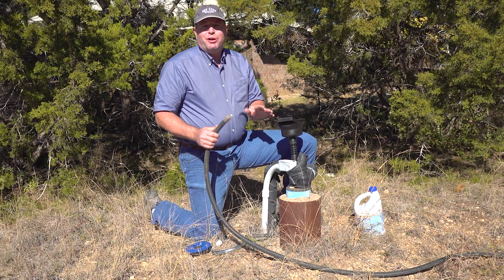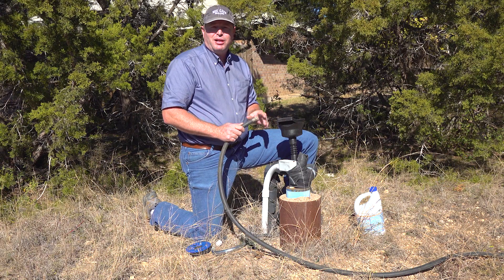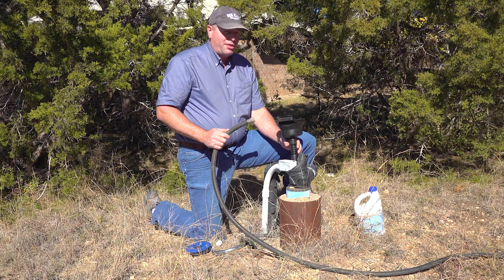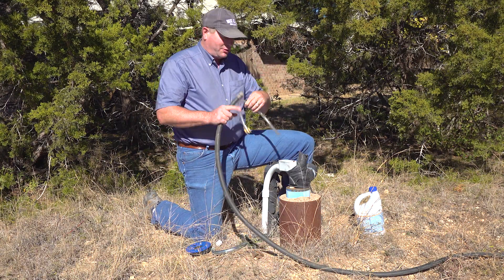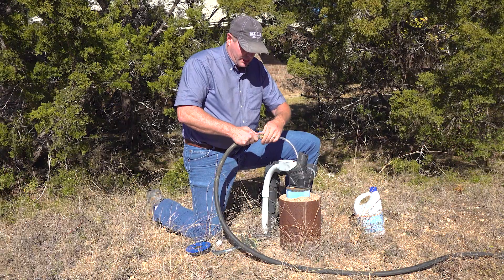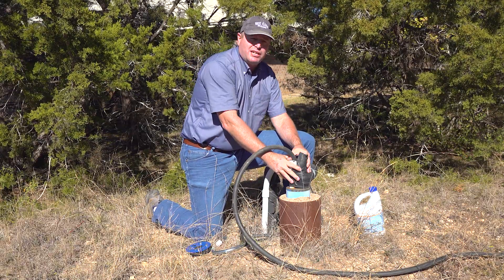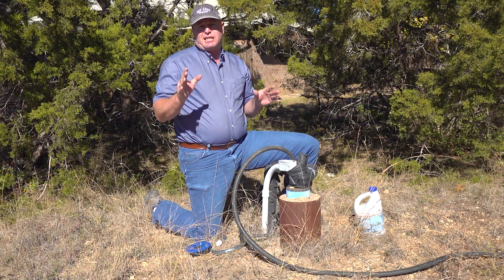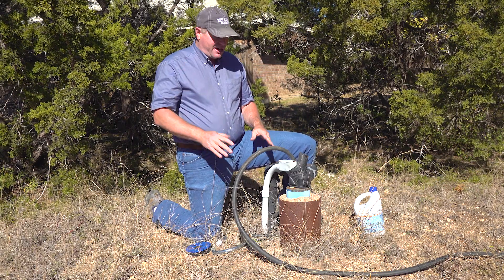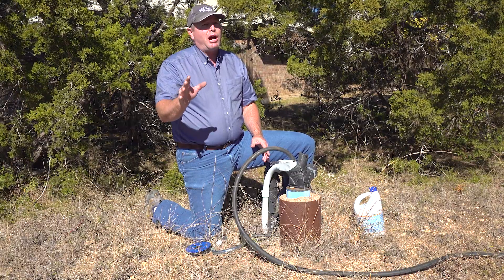Now that we've got our bleach in our well, we need to start mixing it. Run a water hose from the end point of your distribution over here and rinse everything down to make sure all the chlorine got down into the well. Then hook this up to temporarily circulate water. The best way is to ditch the funnel, go back to your clear hose, stick that right down into the well, and hook up your hose. This is going to be running for 12 hours, maybe longer, so take some tape and tape that so it won't blow out. Mix for at least an hour. With a bigger distribution system or a big storage tank, mix longer — at least an hour at five gallons a minute for a standard well, or three to four hours for a big 2,500-gallon storage tank.